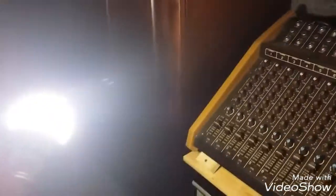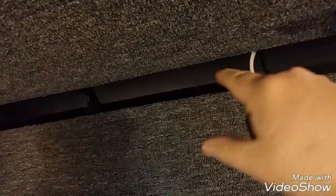Everything as intended kind of sucks the light out of the room. With two lights and one in my hand you still can't see anything in here. The idea was to keep the sound down, the light down, make it a comfortable studio with kind of low light. To get permanent light in here, I always planned to put a board at about a 45-degree angle at that corner, all the way to the end on both sides — it's 12 feet. I'm going to use that for a wiring chase so I need access, so the plan is to hinge it off the top and mount the lights in it.